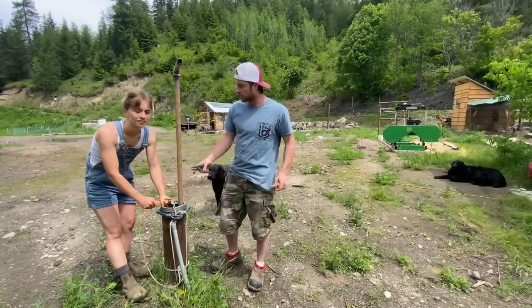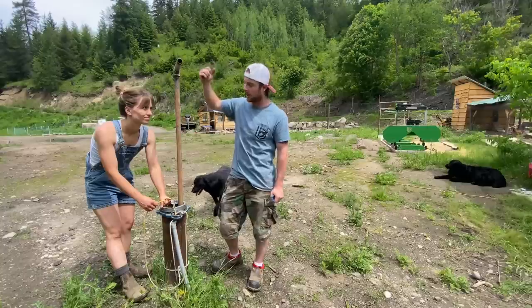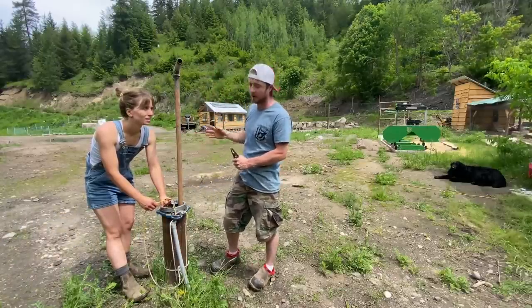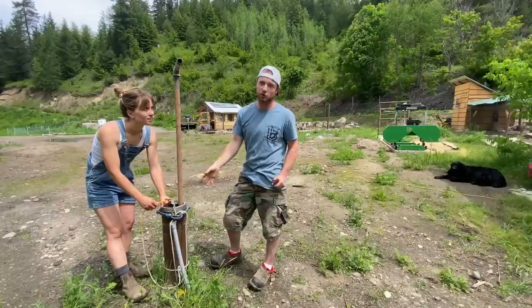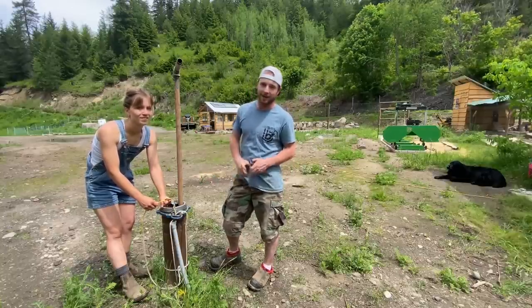We're gonna cut these wires. We got our pitless puller attached. Hopefully we can pop this right out, pull all of this pump assembly out, and then we'll go through the whole setup for you guys. This should be about 50 feet of pipe and wire. See if we can get it. I hope so.